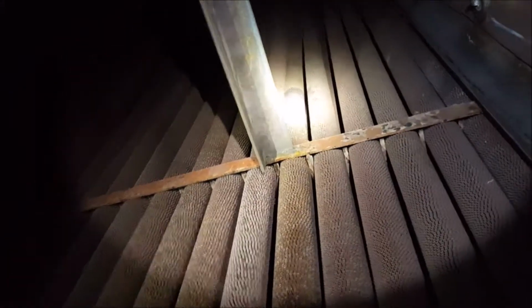And this is 2 Charlie boiler, and I see bubbling water spewing forth from what would be reheater number 2, bank of tubes. It looks like 2, possibly 3 rows back. And this section here should not have water in it. This is cold reheat return going into this section of the boiler. So anyhow, we do have that going on.